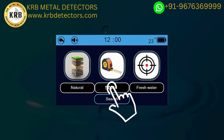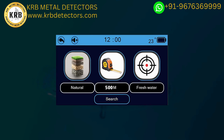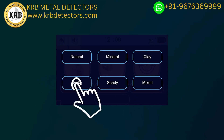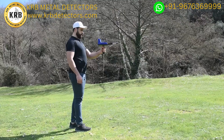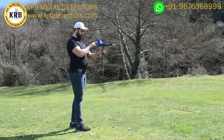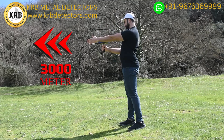Determine the front range of the device; the device will return to the search screen automatically. It is also possible to choose the type of soil in the search area — clay, mineral, natural, mixed, sandy, or rocky — to obtain more accurate results. The device will return to the search screen after choosing the soil type. When clicking the Search icon, the device starts searching based on previously saved settings: target type, front range, soil type, and continent. For example, if the expected front range is 500 square meters, specify the front range at 500 meters. If unknown, you can specify the front range up to 3,000 meters.